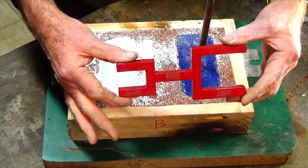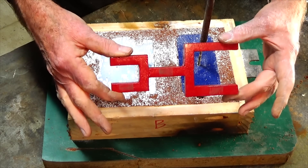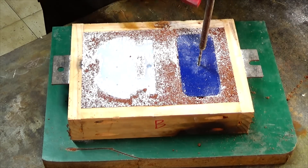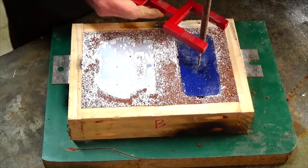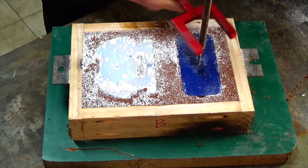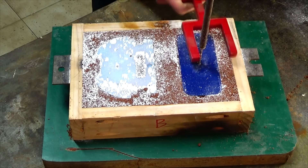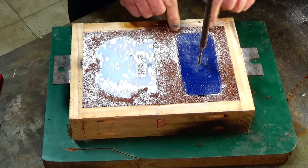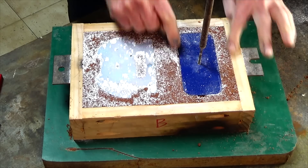This is a rapping tool that was sent to me by a gentleman named Tom Kitchen — you'll find him on YouTube under the name Sand Rammer. He very kindly made this tool and sent it to me. What you do is just simply tap the steel rod from side to side all the way around. If you watch carefully you'll see a gap open up around the edge of the pattern and you might see a few little sand grains vibrating loose as you do that.